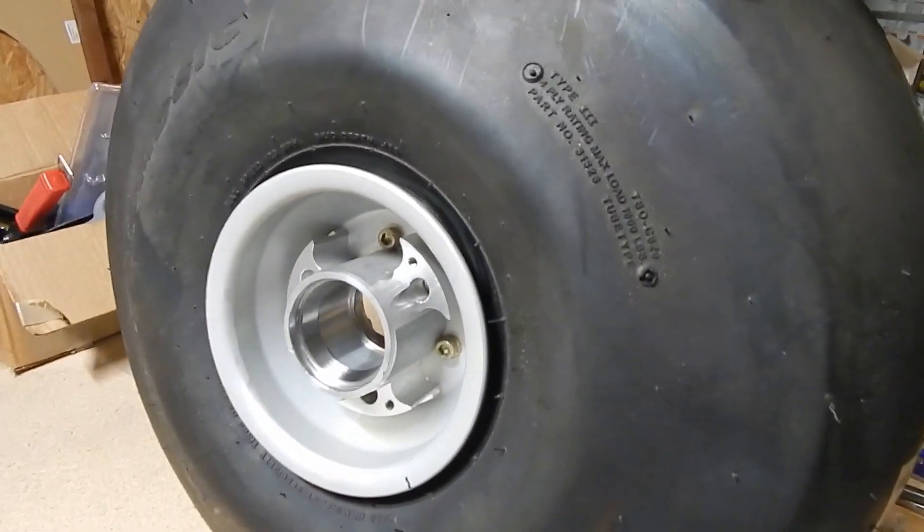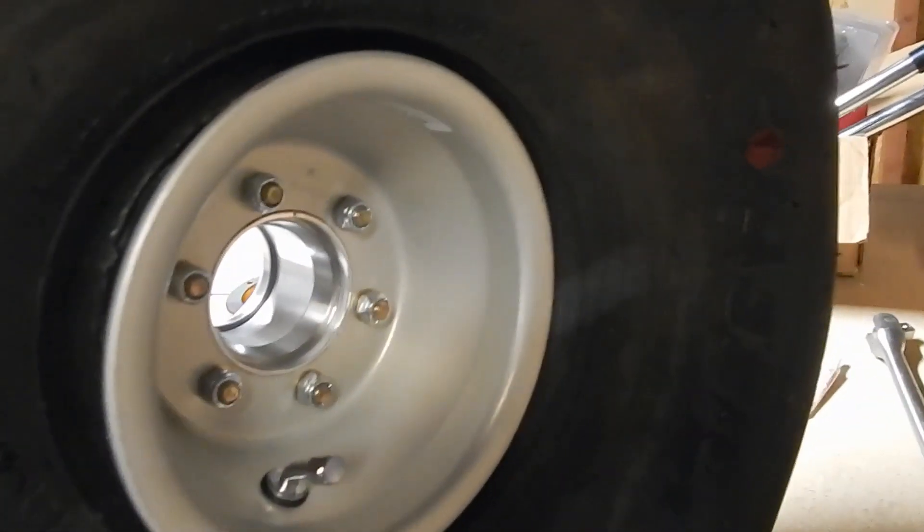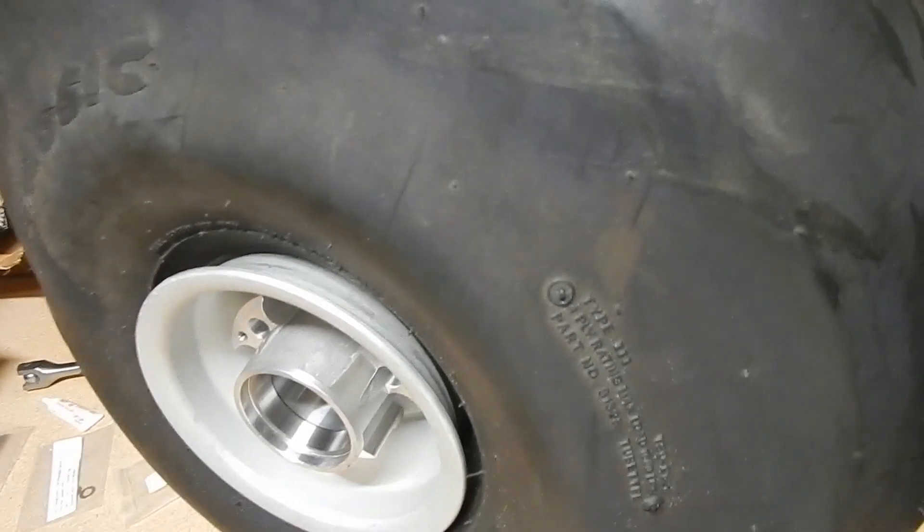I've got my hub bolted in from this side. The torque pressure on the quarters is 100 inch-pounds, so they're torqued. That O-ring is sitting up here, so I'm going to slide it down now by pushing this in. It goes in the crease between the two hubs to seal any air getting out from the middle. After I slide that O-ring down into the middle, I put it on my compressor, pushed down on the tube to get pressure on the seal, and at about 15 pounds both sides sealed.